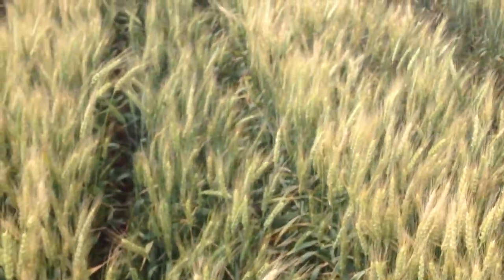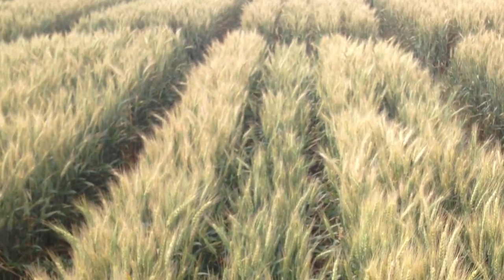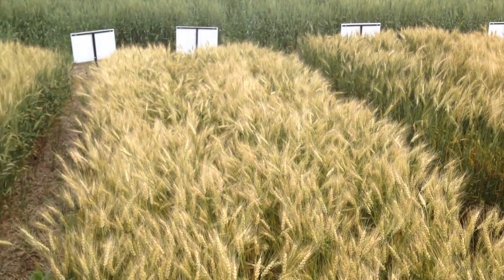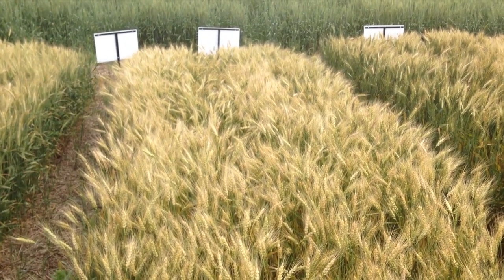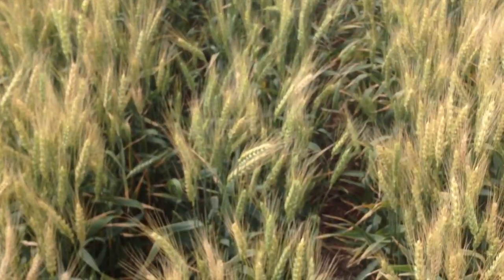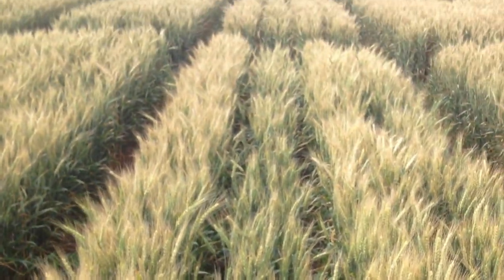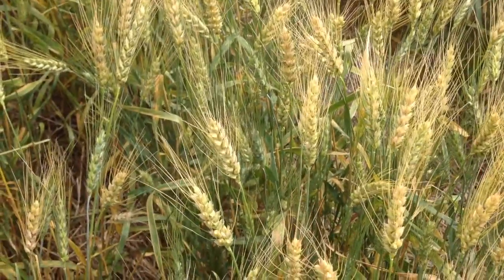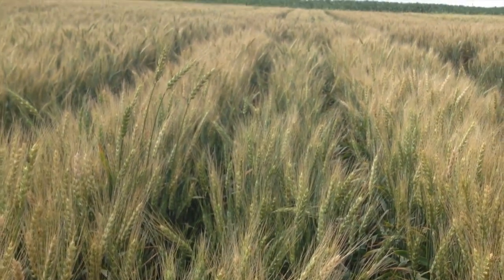In this particular plot, you can see that we've got some depth difference. Probably the front gang, which is the two outside paired rows and the middle two over here, versus the center two, which was on the back gang. The back gang was probably too deep or too shallow. Either way, it could produce a result that looks like this.